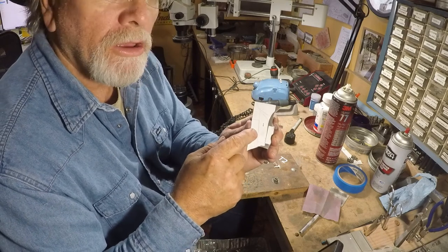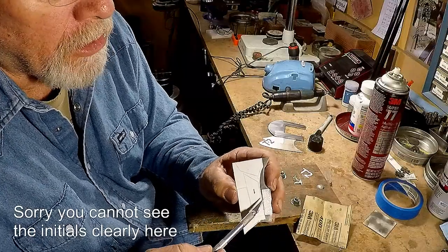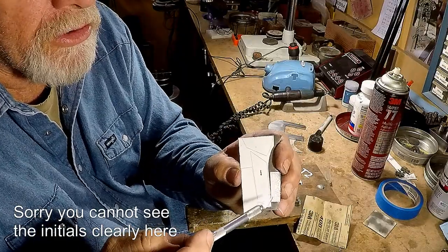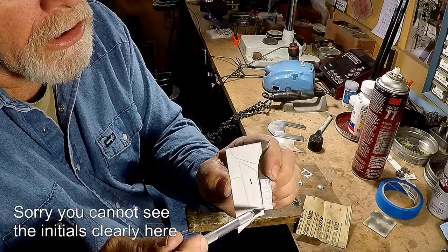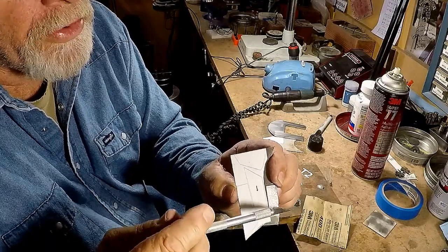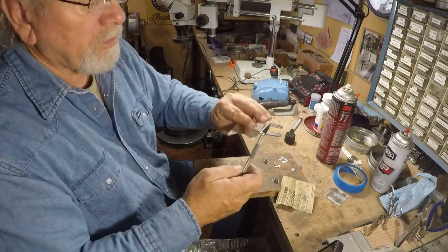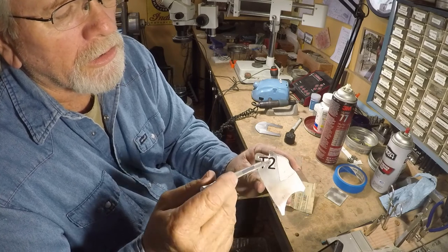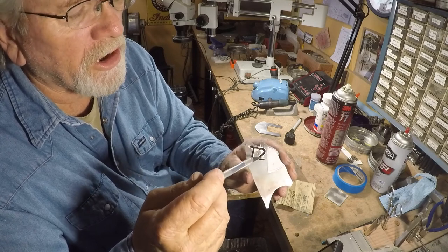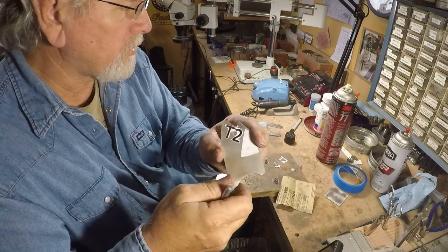When cutting your design, these initials aren't hooked together, but when I cut them out I leave a little bar between them to keep them together. I'll drill a hole, put my scroll saw blade through it, and cut around — that keeps the whole piece from moving back and forth while I'm trying to saw. I had a hole right here, put my jeweler's saw in that hole, cut around, came back, took the saw blade out, and it dropped out. That way the piece stays strong and doesn't flop around.